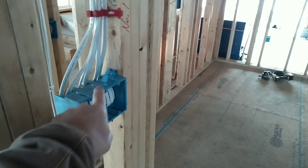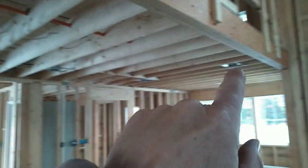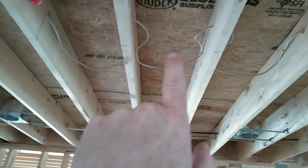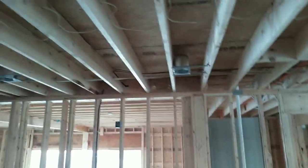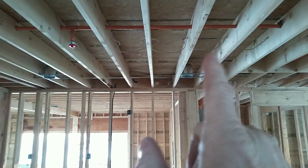Coming into the living room, on this side you've got a three-gang switch box and ceiling cans in the kitchen. This is the kitchen area — it stops somewhere over here. They've got a total of five cans in the kitchen. The other switch is for the pendants over the island — he's doing three pendants. You can see how this wire zigzags back and forth; these staples are stapled loosely because he didn't have a kitchen layout for me to follow. I'll use a hole saw after the island is installed, do a laser off the center, shoot it up and do three equal measurements, drill through the ceiling, find the wire, and do the tie-in.